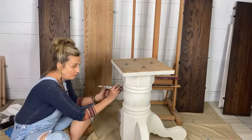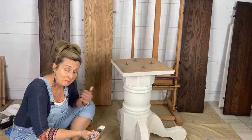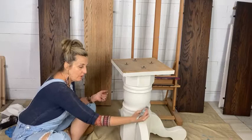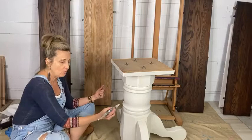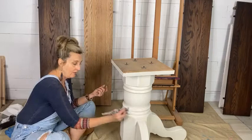The Furniture Duchess wants to know if you would use that strategy on cabinets. One coat of chalk paint, then cover with silk. Probably me. That's me. Don't have to. There's other things you could do. You could use a coat of Boss if you wanted to. You could scuff your cabinets and just go straight silk. So what do you prefer? What makes you feel better about it? All of those would work. Boss and then silk. Chalk mineral paint and then silk. Or scuffing and then silk. It's totally your call.